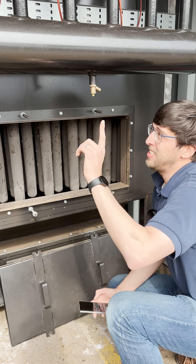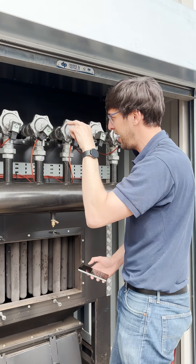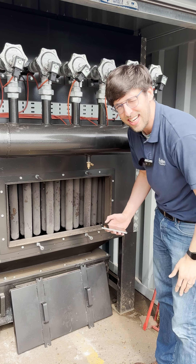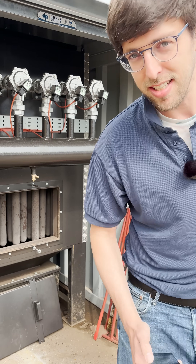What that is doing is turning on one of these solenoids here, which is letting a blast of compressed air go in through here, go down the pipes there, and giving a reverse air cleaning action on the ceramic filters, keeping them nice and clean. That's all. Thank you.